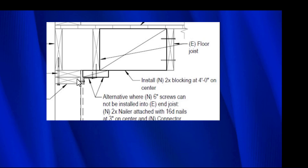We're going to look at a different way to do this that's a lot simpler. What you can do is go to this joist right here and make enough room to put your hand there. You take this joist and you notch it — every 16 inches or so — so you can reach your hand up. You just reach your hand up, use a palm nailer, put in your L90, and you're all done. Then you forget about all this nonsense — it's completely unnecessary.